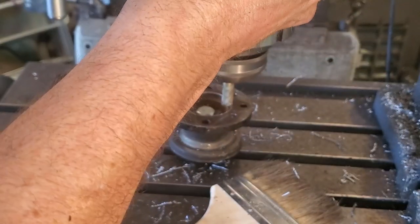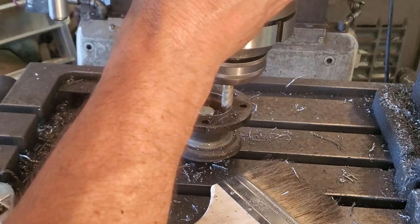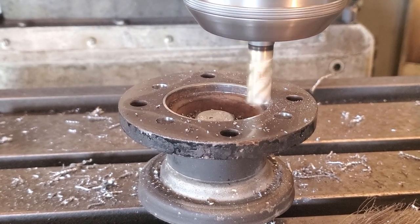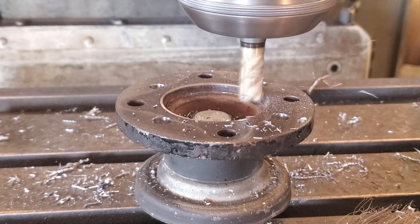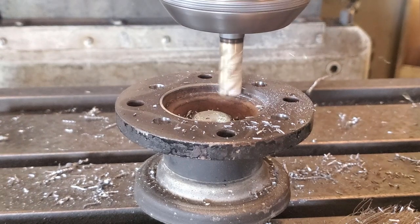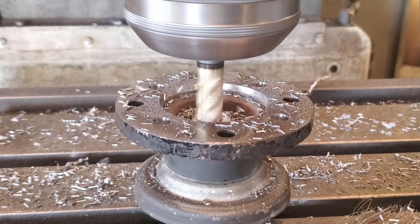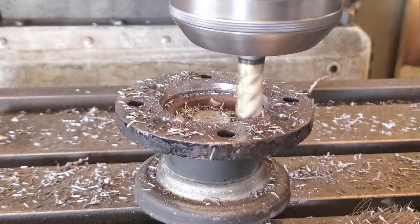All right, now I'm going to come down 110. So you want me to climb cut this? That's carbide. Climb cutting. That's a solid carbide titanium nitride. I went 110 deep. This is less than 100 thousandths projection. It's about 95 or something like that.